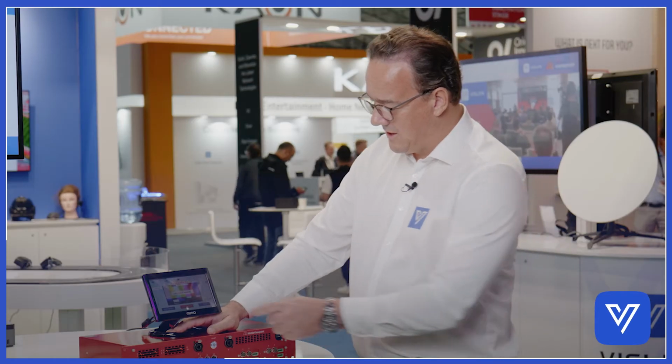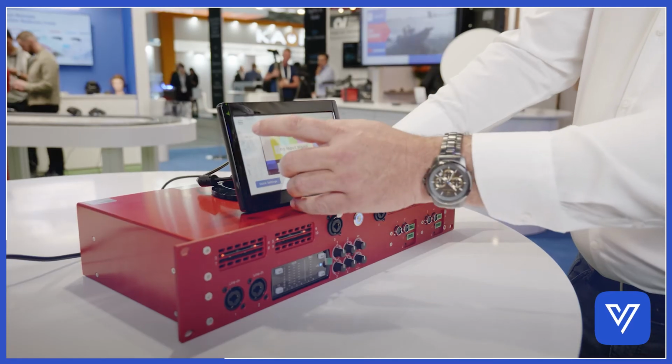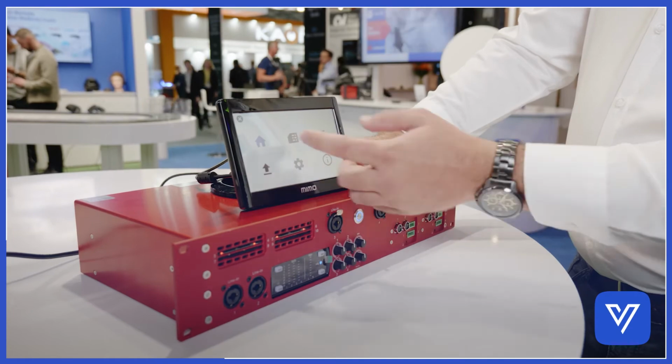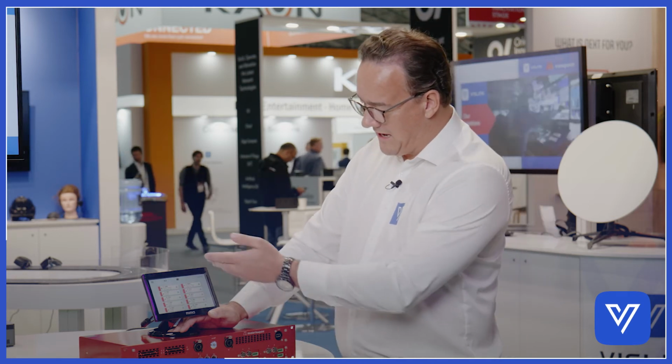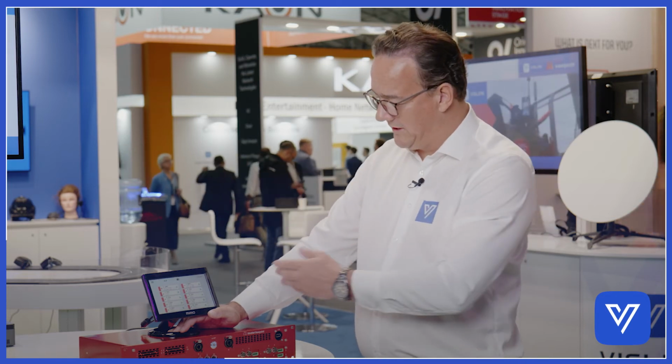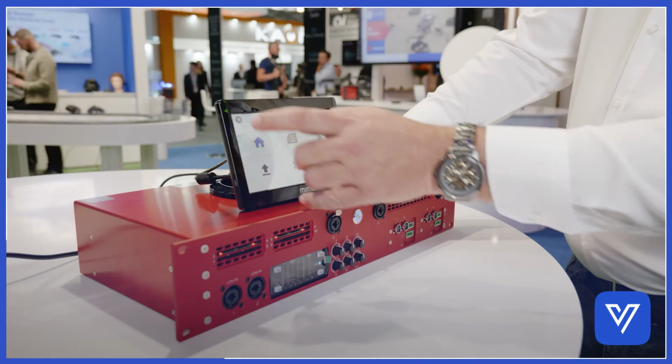Additionally, you can actually change settings, such as, for example, the SIM card APNs and which one is your primary. So for example, your LAN connection would usually be your primary connection, as that's the free available connection you have. And the SIM cards you can then set as your secondary way of connecting. And this means if the primary connection starts to fail, we start bonding in slowly data from the SIM cards.